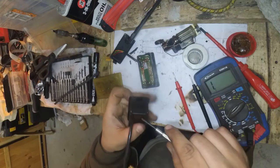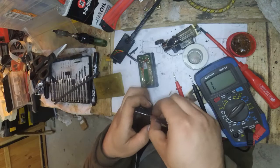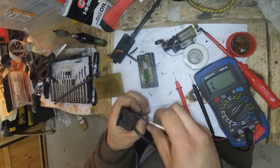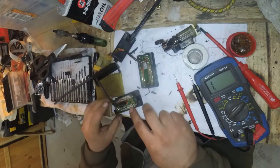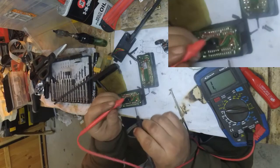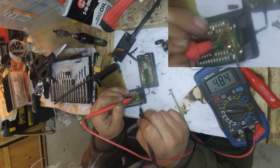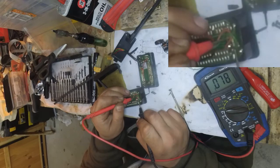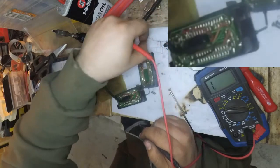Apparently now 430 ohms — or is it 400,000? So I'm changing the range just to confirm because I don't know how to use this multimeter. So we have 400,000 across. Now I believe what I read was that it was supposed to be 100k and not 400k. I'm just going to take this apart and test this one to confirm. The spare reads 78,000 — that's a lot closer to the 100k I was expecting. This is actually 20% off, so this resistor probably needs changing as well as it's out of its tolerance.